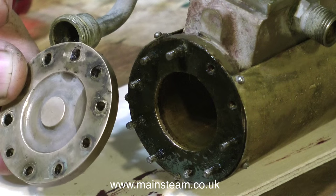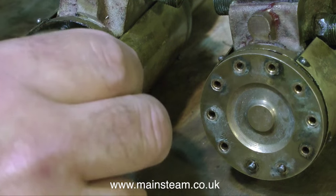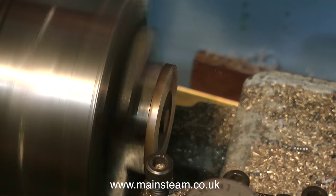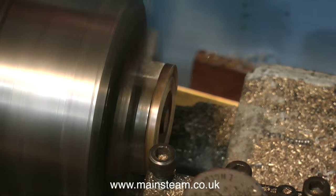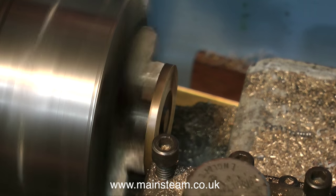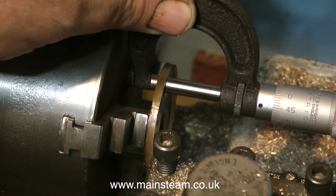I have to put this right. The easiest way is to unscrew all the cladding, but I initially thought it was held in with small rivets — they're actually very tiny screws and they're not going to come out. So the first thing to do is clean up the cylinder covers. Here in the lathe I'm refacing the front of both cylinder covers to make them identical, using a micrometer to measure the first and then machine the second to the same size.